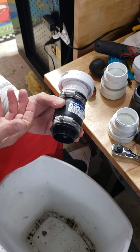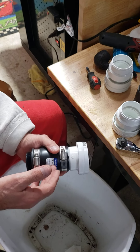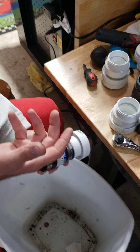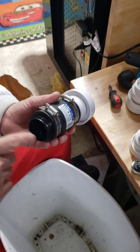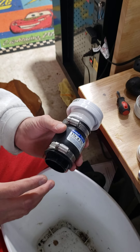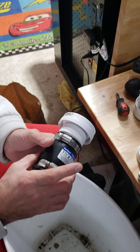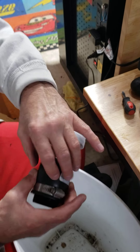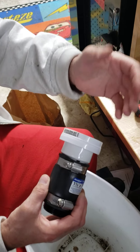Like I stated in the prior video, if you get some backflow up in your plumbing pipes, it'll carry some debris up and get on the valve. Also the valves will grow some slime and snot on them. So my goal here is that this first valve takes the beating. And if it leaks — which they have been, some of them — they don't leak all the time. Sometimes they leak, sometimes they don't.